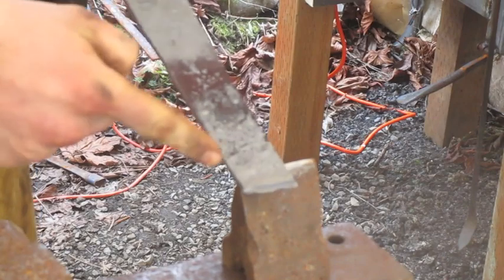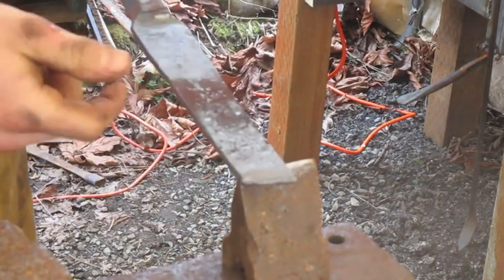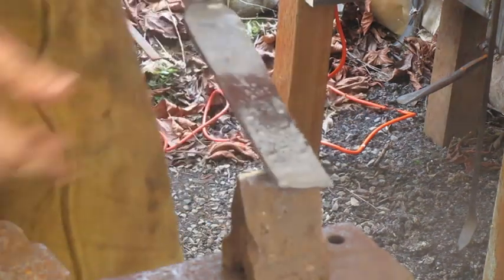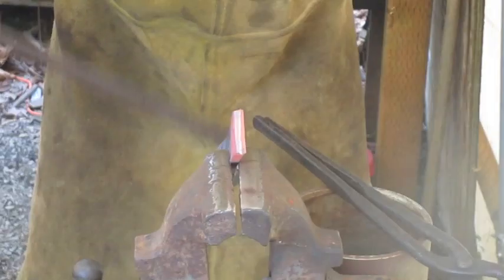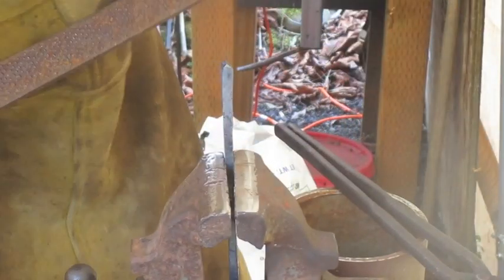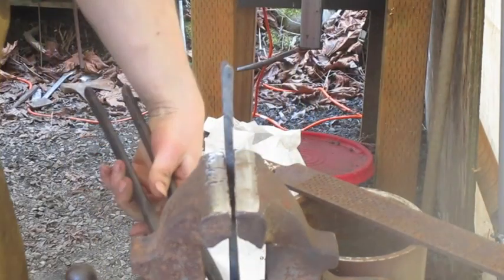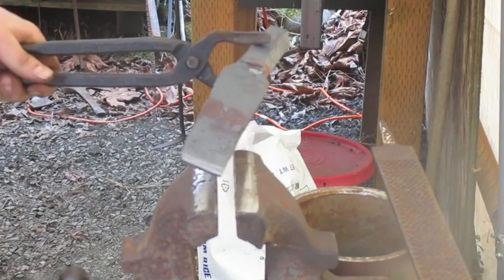Bit of a rag on there, a little bit of steel sliver. So we're going to heat this up, bring it to the vise, and get a hot rasp on that. Woo! Coming up and attacking me. Alright, just got all those sharp corners and stuff that could create cold shuts, and smoothed it all out.